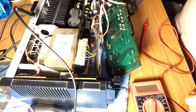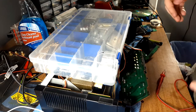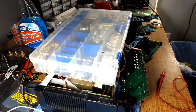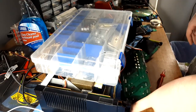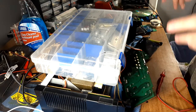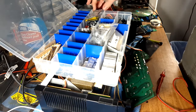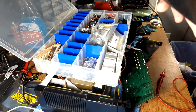These are just normal cool-white 5mm LEDs. So we have 16–17 volts AC unloaded from the transformer. AC RMS — to find your peak-to-peak which will be DC, take your AC RMS and multiply it by 1.414. That's going to give us about 24 volts peak. So what I'm going to do is cut the two AC lines on this harness going to the front, put in a diode to rectify it. For a 3-volt LED drawing 20 milliamps, a 1200-ohm resistor should work. Because I'm not certain what my Chinese LEDs draw — they were never listed — I think I'm going to go for about 1500 ohms.